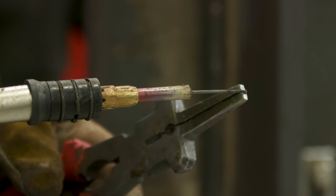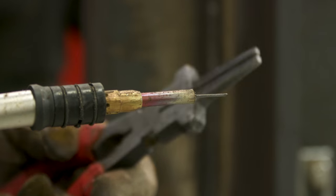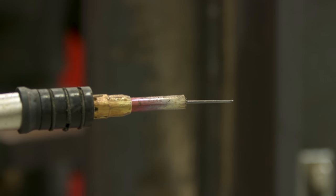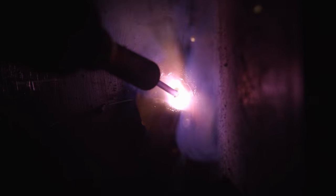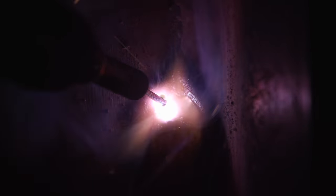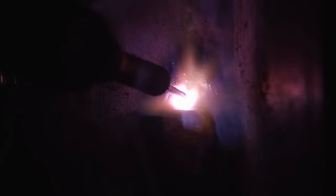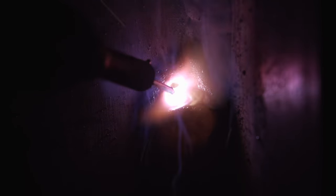From the last pass I have this ball on the end that's going to be very difficult to ignite, so I won't get a good arc start. It's really important to clip that wire off each time you're done, and then I usually set my distance at three-quarters to one inch before I even start welding and try to maintain that the whole way up. Now we're going to do pass number two — I'm going to terminate it about three-quarters of the way up, and then pass number three we'll stop about halfway, so I can show you the three-pass profile and exactly where they're interacting. I'm keeping this about the center of my weld — 50% on the left, 50% on the right. As I go through here I'm doing about a two-second pause on each side, slowly pulling that puddle up. It's a slow process — take your time, go nice and easy with it.